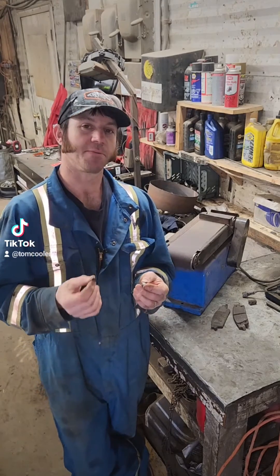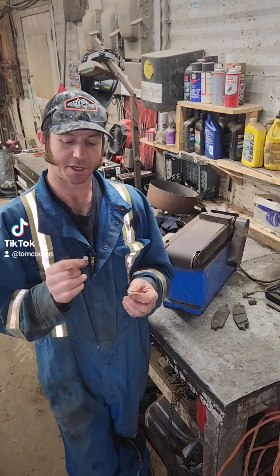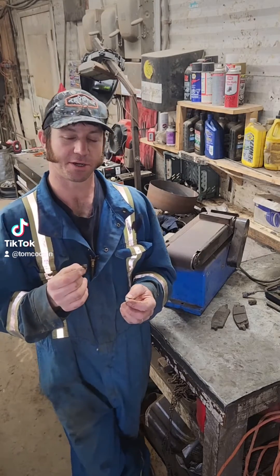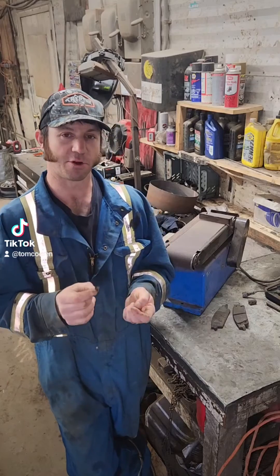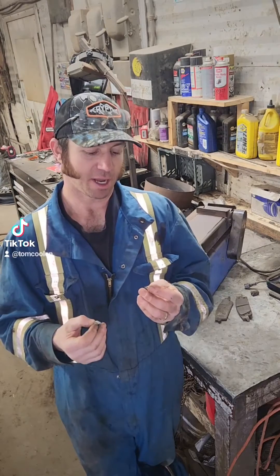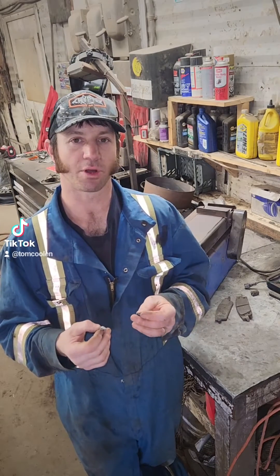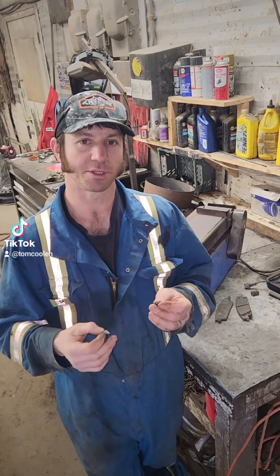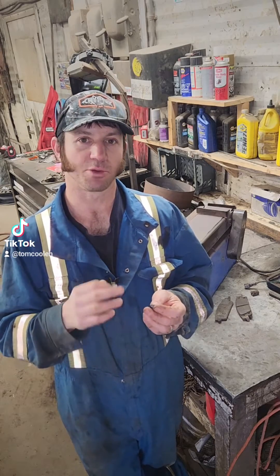Now this steel here is actually a few different powdered metals all compressed together and baked to form this cup — what I call a cup, the manufacturer calls a bearing. They remain porous so the grease can get into those little pores and keep the wearing surface lubricated.